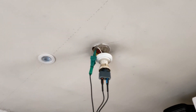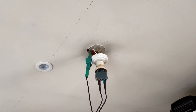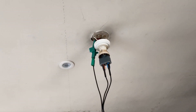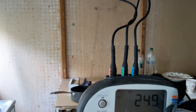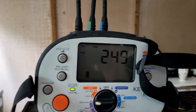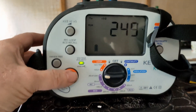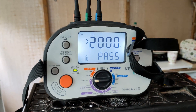This is the only way I know of to do it. Obviously you've got to take great care in doing this because that is now live. However, it does work. So we've got all those leads on, connected into the line, CPC, and neutral on the tester. You can see we've got a voltage of 249V. So I'll press 30mA and start the test — and we've passed.